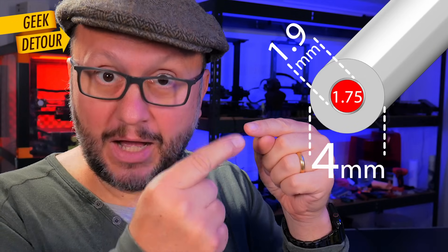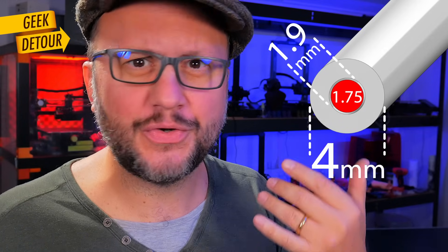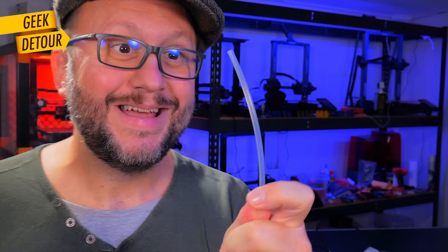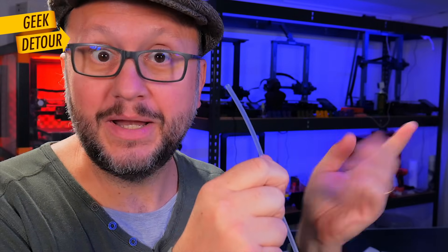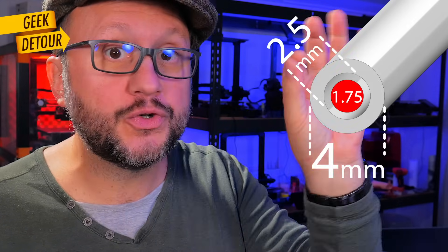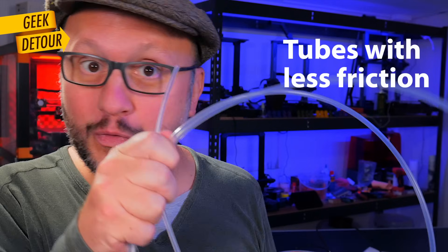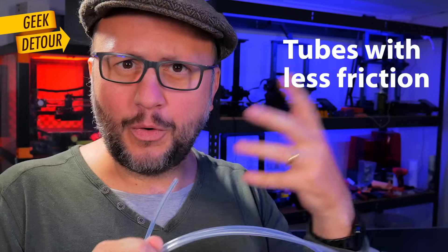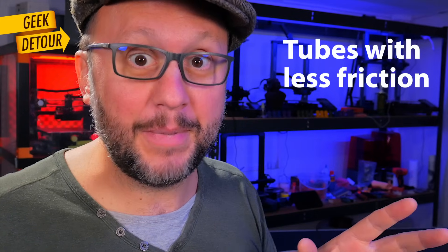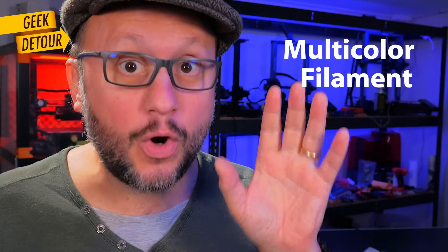Here comes my first suggestion for Sunlu. My S4 came with tubes — the regular Bowden tubes that are 4mm outer diameter and 1.9mm internal diameter. It doesn't need to be so tight. I bought a tube that is 4mm outside, just like the other one, but 2.5mm inside — much more room for the filament to run loose with less friction. That's suggestion number 1: please ship the S4 with tubes that have a less tight internal diameter. It goes before the extruder, it won't mess with retractions, they don't need to be tight. The less friction, the better.